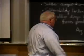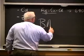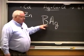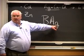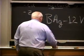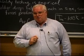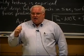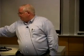They actually even sell silver solders, silver braze alloys, I should call them braze alloys, that have very low volatiles. The American Welding Society designates braze alloys or brazing wires with a B designation. Welding electrodes are with an E designation, but B for brazing, and silver alloys are BAg. And obviously we call them bag alloys, so you have BAg-1, BAg-2, you can have BAg-12, and that's a specific alloy of silver, copper, zinc, whatever. But if it has a V after it, it means that it's specially formulated from very pure silver or very pure copper, and it does not have any significant amount of easily volatilized elements like zinc, even in minor quantities. And so it's suitable for brazing in a vacuum furnace, because in a vacuum furnace, the volatile elements come off more easily than at 1 atmosphere.